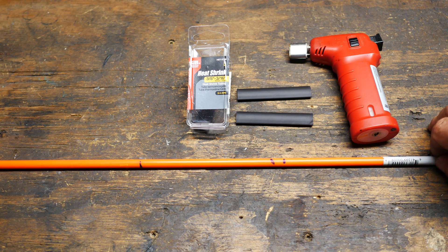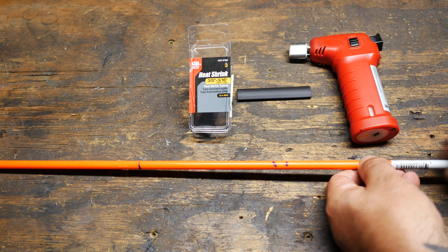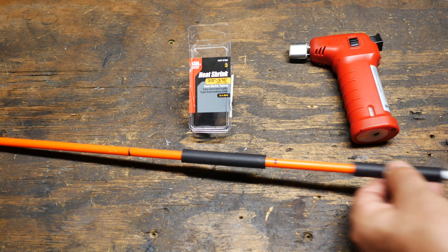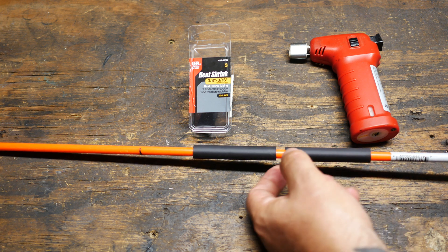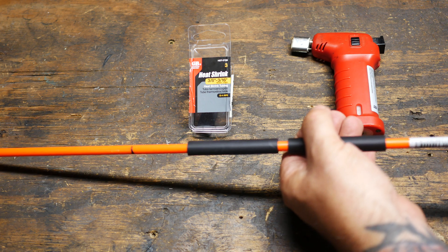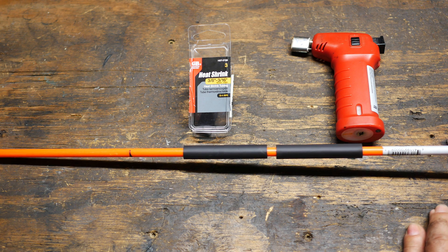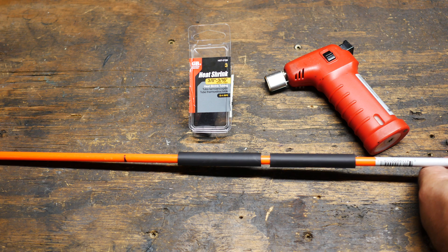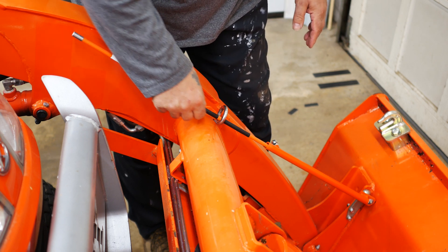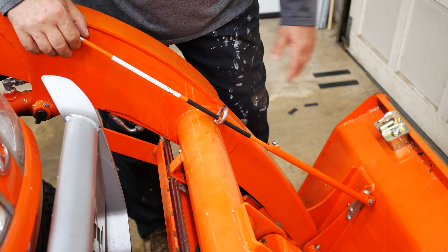Here's the completed job. You can see how nice the heat shrinks look once they're shrunken down — very neat, very professional. That orange spot is inside the eyelet, so I'm pretty happy with this. It looks pretty good. Let's take it outside and see how well it performs. We're outside now. There's a torpedo level on the bucket — you can see the bucket's level. When we roll back and take a look at the level gauge, you can see it's right inside the eyelet, just like it's supposed to. Let's put the camera on the tripod and do a quick functions check to make sure nothing's binding or hanging up anywhere and that everything's moving properly.